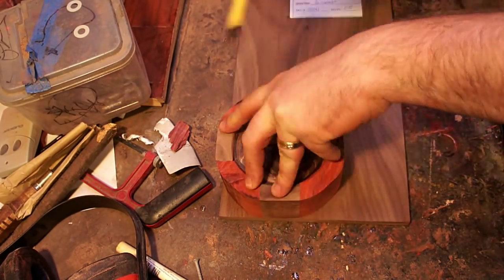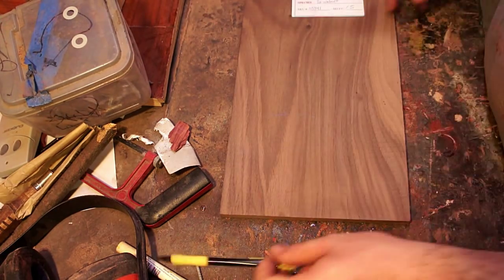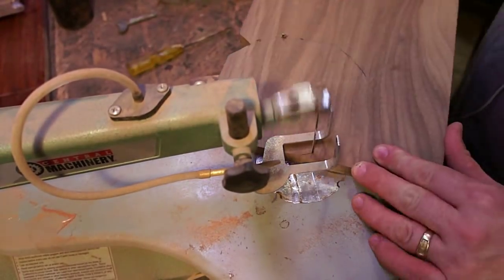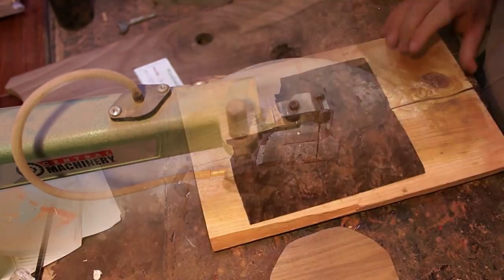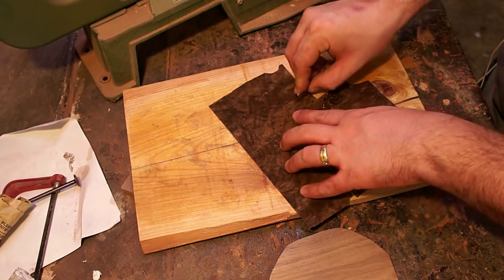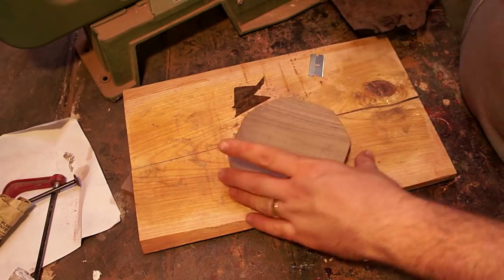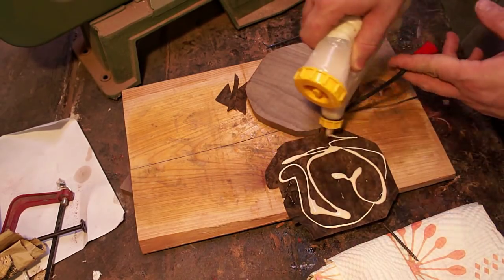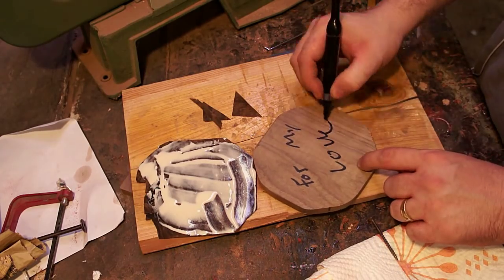Now I'm moving on to the top. I need to have the bottom piece all correctly done so I can figure out the exact shape for the lid. So I'm marking that out and taking it over to the scroll saw. It was pretty wild doing it on the scroll saw — I didn't really realize how much that grain was going to distort after I cut through it, releasing all that tension. I wanted that walnut to match the side pieces but also wanted a little bit more interest on the top. I didn't know exactly what direction I was going, but I knew I wanted something kind of curly. So I looked at my veneers and found this one — I'm not sure if it's walnut but the color is close enough and it matches really well after everything is finished.